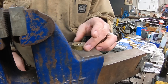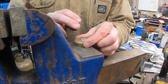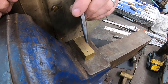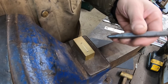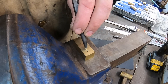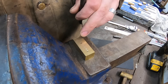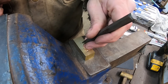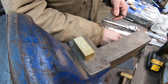But if you don't have a milling machine, you have to do this by hand, and the sculpting aspect comes into play after we've fitted this to the tang of the knife. Next thing to watch out for: drill your pilot holes smaller than the finished width of the slot, which is the width of the tang. I like to go about 20 thousandths smaller. Make sure your center punch holes and the holes you drill are in a nice straight line so they don't wander outside the width of the guard.